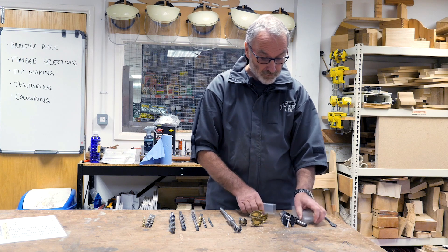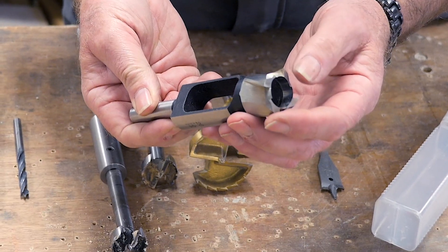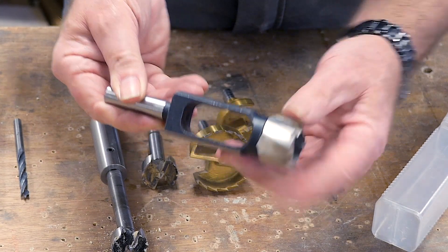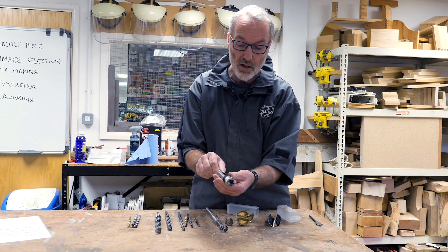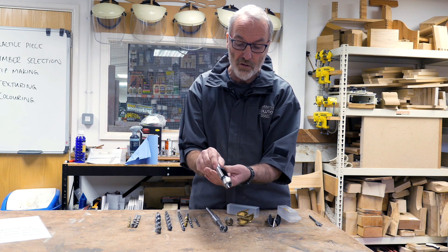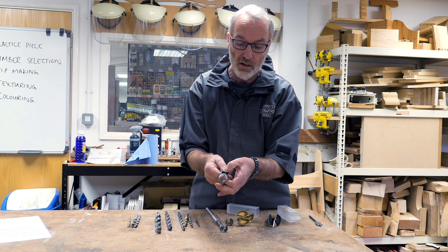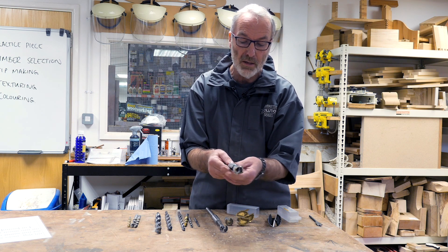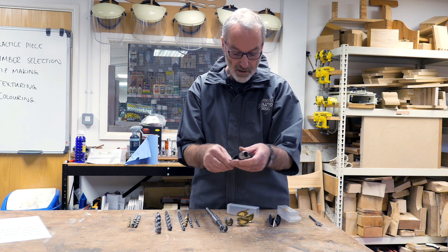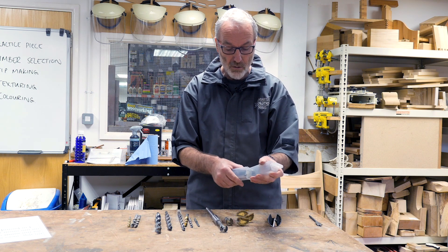There's also a different style here which has four cutting spurs and four side flute spurs, and the waste material disappears up through the center — it's almost like a plug cutter, so the waste material is held up through the middle. You can't drill very deep holes with these, but for plug cutting they're absolutely ideal. This one was made by Fisch in Austria — really top quality.